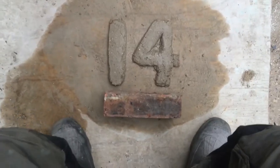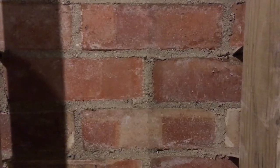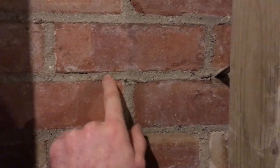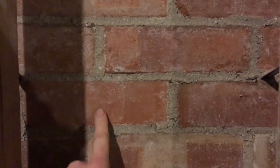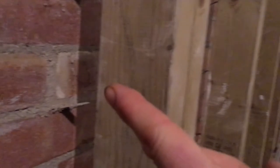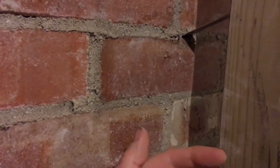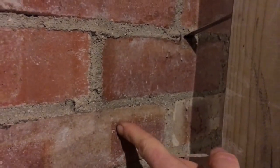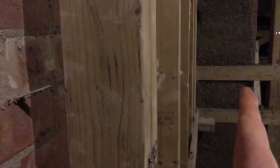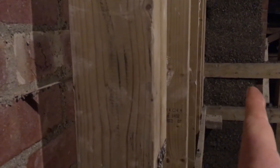It's episode 14, brick cladding. Now, you can't put hempcrete up against a condensing layer. That is a cold surface, which is vapour impermeable, where condensation forms, because that condensation will eventually rot the hemp. But because I've used lime mortar, every one of these mortar beds is vapour permeable. So I can actually put the hempcrete right up against this wall. If any moisture is making its way out of the building in this direction, it's not going to get trapped here and form condensation. And if any moisture makes it through in adverse weather conditions, it'll breathe back out again. So the hempcrete goes all the way from here to 270mm out here, and that makes up the thermal performance of the wall so it matches the rest of the building.